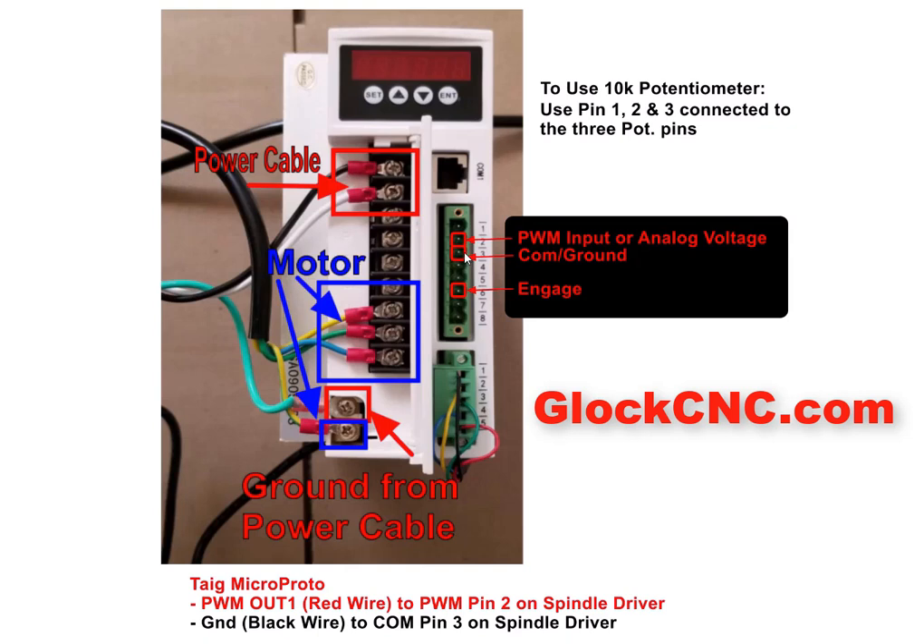It's really that simple. Now if you are going to hook up to a CNC system, whether you're using pulse width modulation or you're using an analog voltage system — maybe a 0 to 10 or a 0 to 5 volt — these are the two pins you're going to use right here. This is going to be the common, and this is actually going to be the signal pin. Now if you have the option on your breakout board to use enable to start and stop the motor, it is right here — this and common are the two that are used to do that.